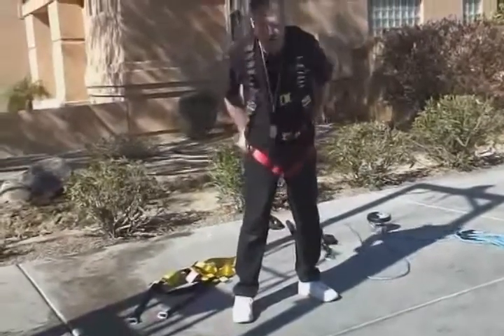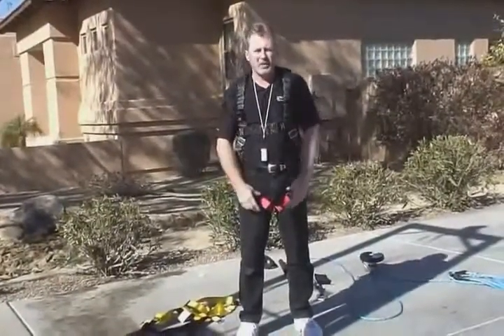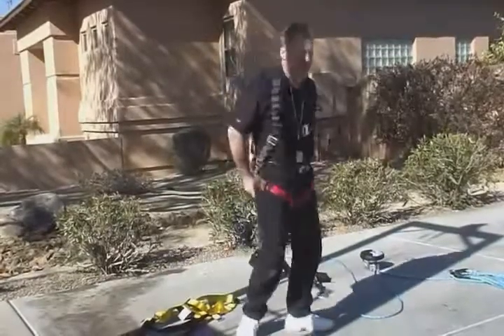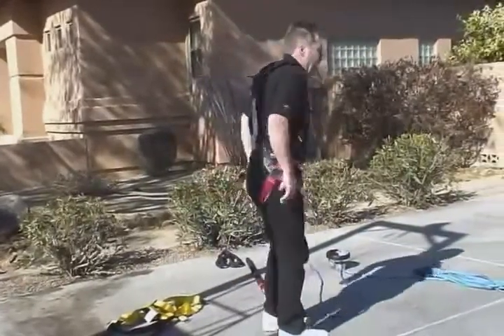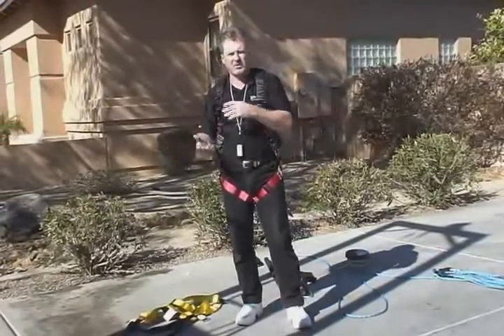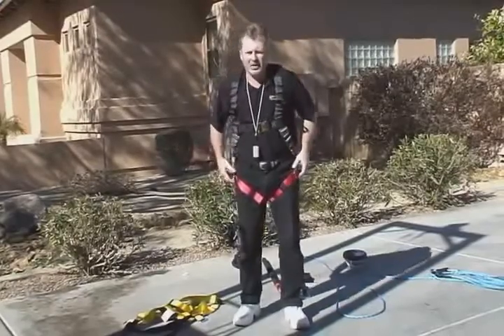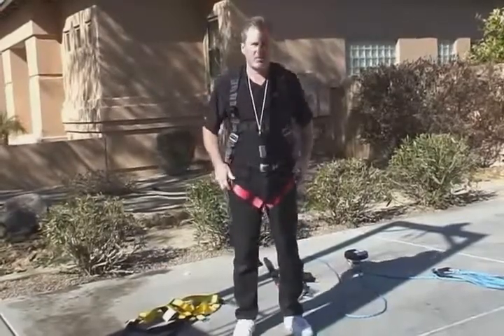In this configuration, if I take a drop in this harness, instead of having a tourniquet, I have a lot more surface area. I actually have something where I can sit. It gives you another option besides the exercise straps, especially if I'm knocked out — I'm in a saddle to begin with. So it gives your employees a little more time as far as rescue is concerned.